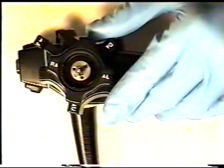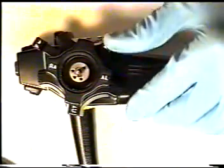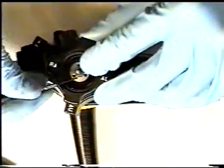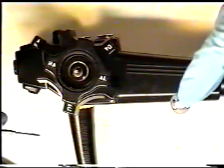Using a Phillips head screwdriver, unscrew the 2 small Phillips screws in the left-right pressure plate bottom retaining ring. Be sure not to lose these 2 small Phillips screws. With a small screwdriver, remove the locking ring. Put this with the other parts in reverse sequence.